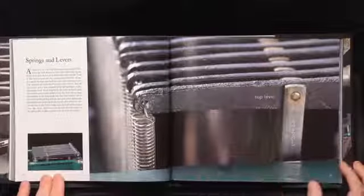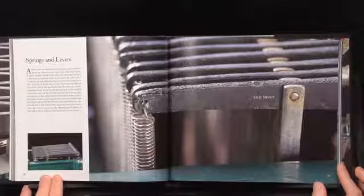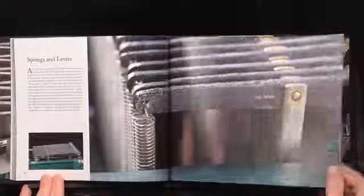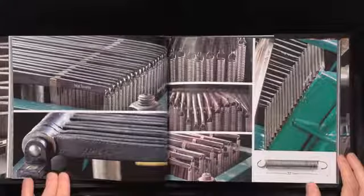The springs and levers at the top are integral to the machine's operation because they are where the summation occurs. These springs were Michelson's great insight. He'd considered using fluid pressure and electrical currents to add sinusoids, and decided that springs were, and I quote him here, "the simplest in practice." Despite their importance, it's easy to forget about these parts because they are a foot or two above the head of the operator. The springs in this machine are in great shape, but they can wear out.